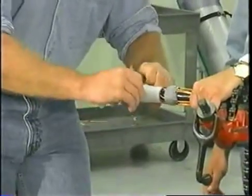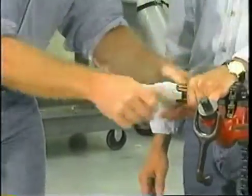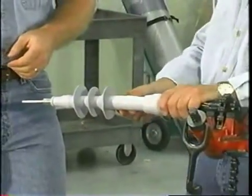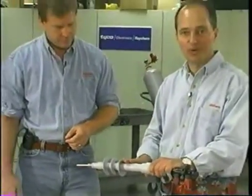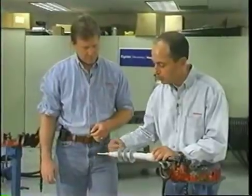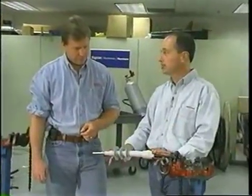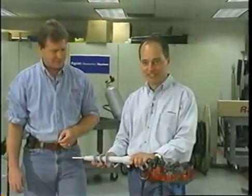Now to finish this installation off, you simply want to grab these ears and roll this flap over the top of the neutral wires. And finish — stick your fingers underneath that, and that's it. And now you're ready to energize the circuit? We're ready to energize the circuit. So we have stress control, you know the stress control is in the right spot. You got sealant, you didn't have to put any grease in there, you didn't have to put a wrap of tape up here to seal the end, and then you're ready to energize the circuit. We're ready to go. Well, that's pretty easy. That's it for the cold applied termination.